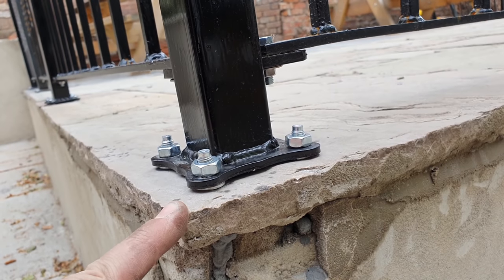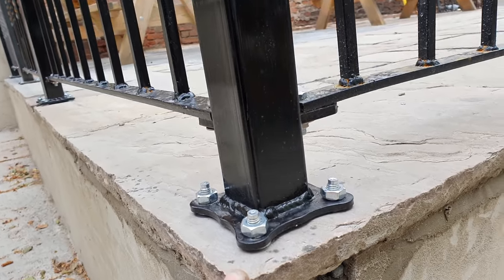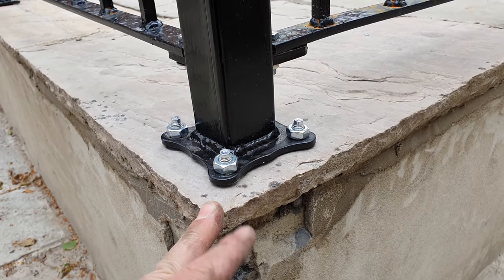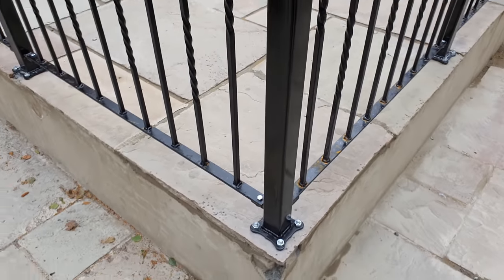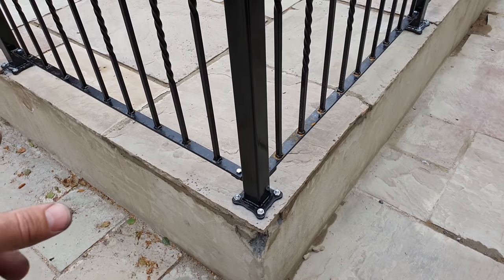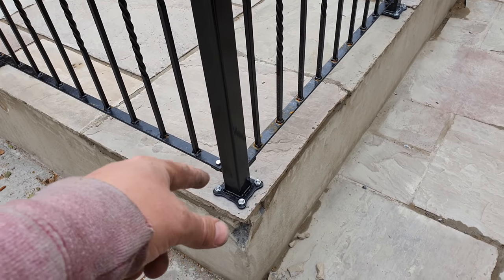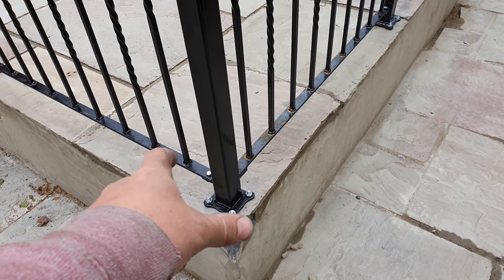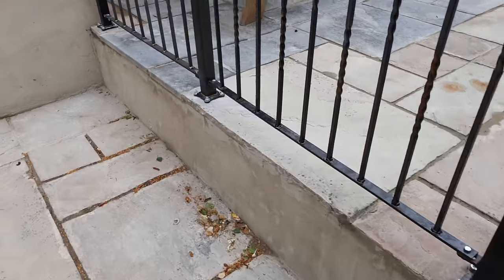These slabs are also really quite strong. I managed to put four 12mm holes into the corners, pre-drilled of course, with a smaller pilot. But we've had no cracks whatsoever on any of them. If I did this again, then I'd probably mark out for the posts as one of the first things that I did, and I'd set them into concrete and the posts would go through. And then I'd cut corners out of the slabs to accommodate that. But as it is, it's worked.